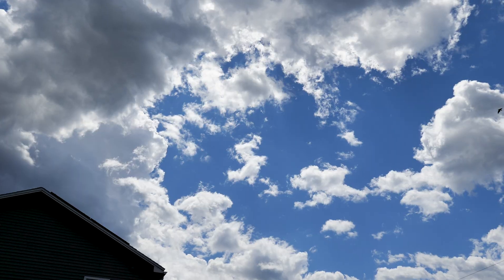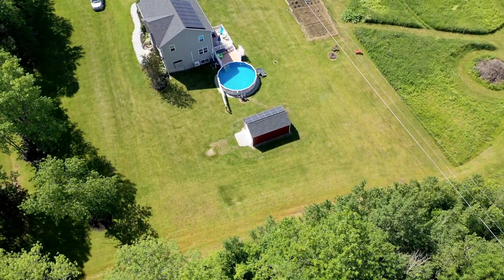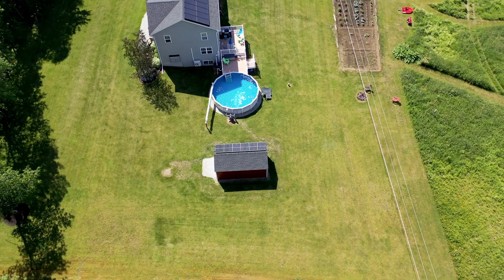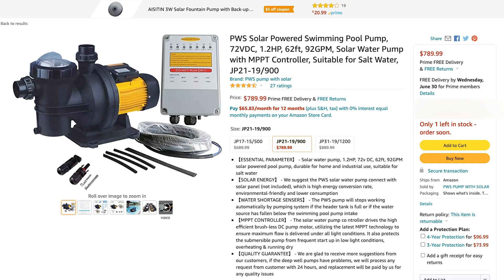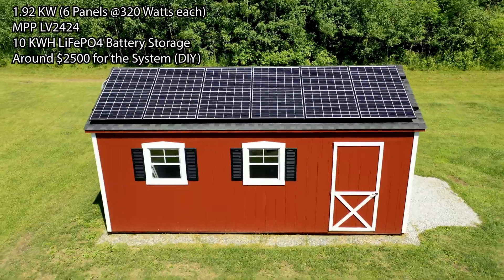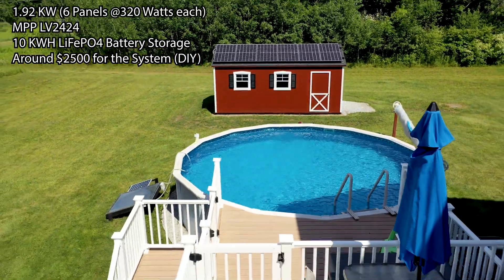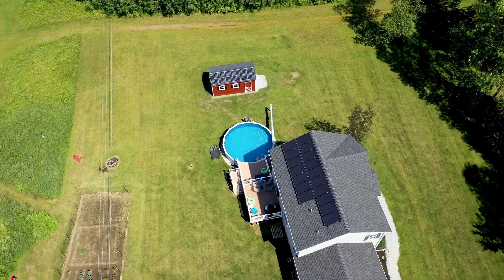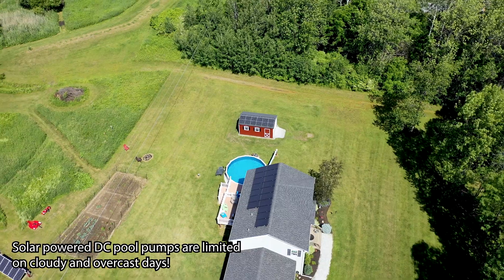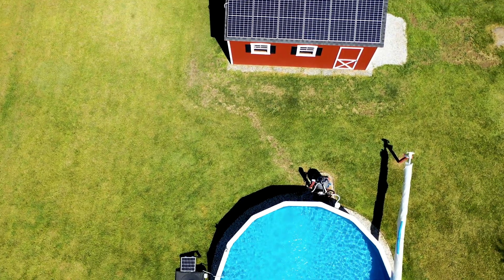Today's a great day because it's partly cloudy, so I can give you a comprehensive overview of how the system functions both when it's sunny and when it's cloudy. There are two options most users go with: either using a renewable energy system like the one I've designed for a shed, or installing a dedicated DC solar pool pump operated directly off solar panels. Both systems have their advantages, but I ended up choosing a small DIY renewable energy system. This system easily powers our pool pump shed as well as other items such as tools and devices. A major advantage is being able to use a current pool pump without having to change any of the plumbing. Dedicated DC powered pool pumps are more efficient but often require installing an additional pool pump when the sun isn't sufficient. I'd much rather use the solar panels in our shed system to not just power a pool pump but also to use that energy for many other applications.